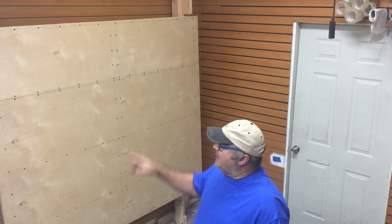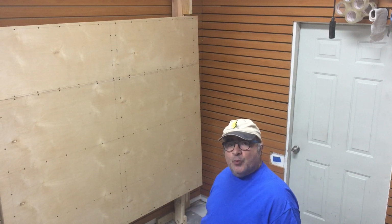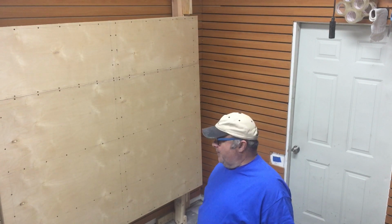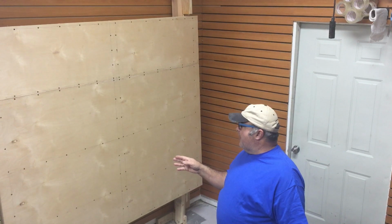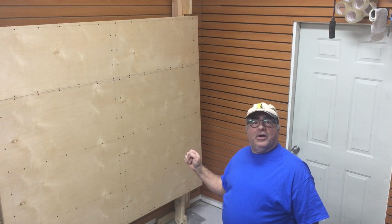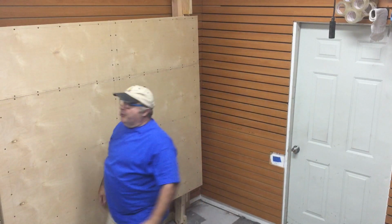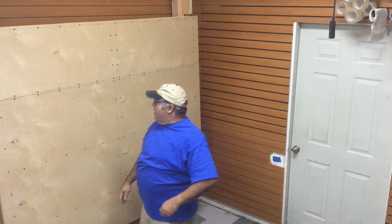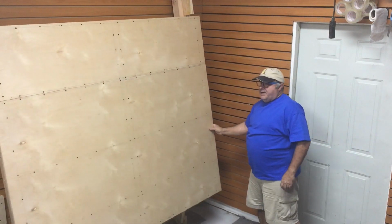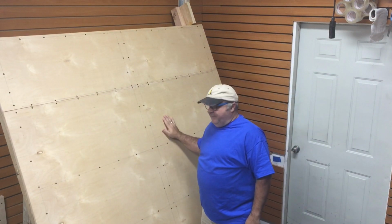The bed is approximately 64 inches by 76 inches wide. For the particular CNC I'm building, this allows for a 4-foot by 6-foot board with the appropriate 2-inch clamping area all the way around the sides. An additional feature is the 2 little pins that are placed on the garage door rails. Now these could be placed anywhere. I chose to put mine to have my table come out to 65 degrees, which is a nice convenient angle.